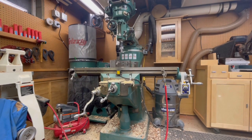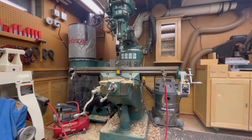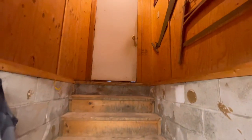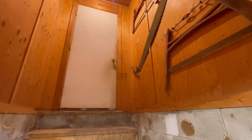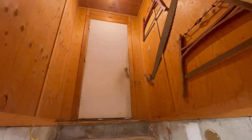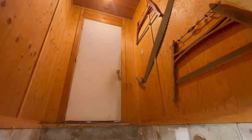It was quite a project for me and my dad many years ago that we tackled bringing this machine down here in the basement, and it all started in the stairwell here. We needed to support each stair tread with a 4x4 post right down to the concrete, and then with the help of machinery, straps, and a homemade sled that we built around the milling machine — which you guys are going to see here in pictures — we were able to slide it down the stairs.